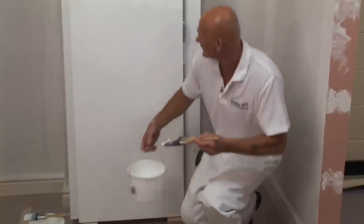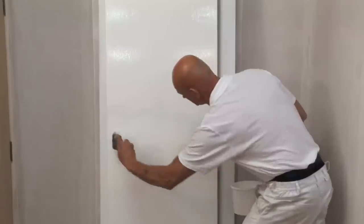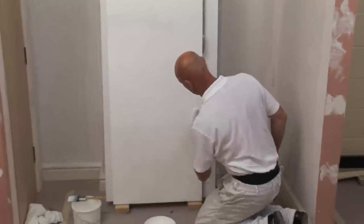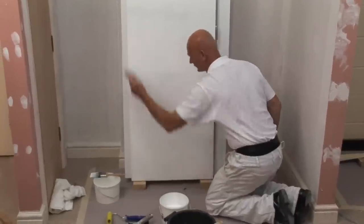Once you've done that, it's just a repeat. Again, lots of paint on — a real good wet coat. If your client wanted a slightly higher gloss, you would then put a second coat of gloss on, making sure that you leave it the four hours between recoats. So again, lay off — get a nice even spread, and then again, the flags or tips of the brush.